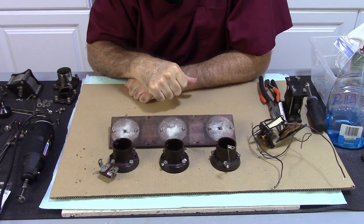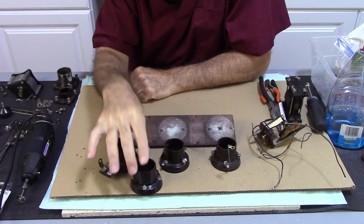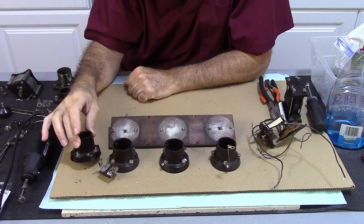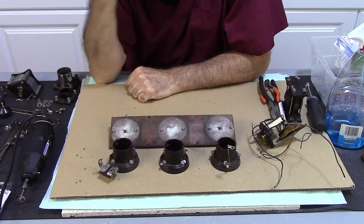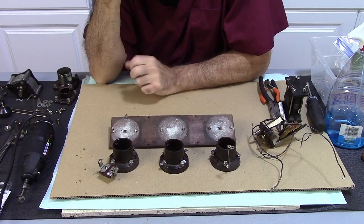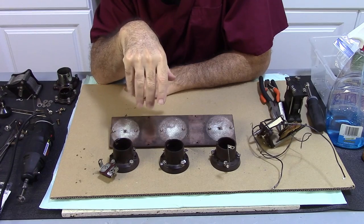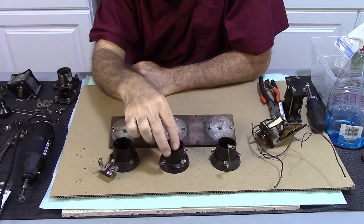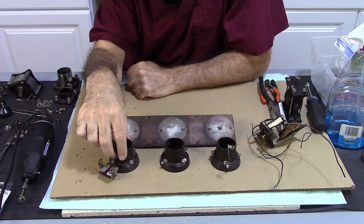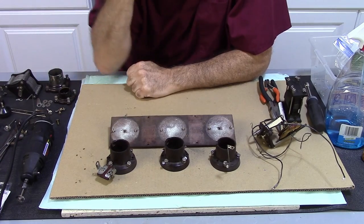But doing some research, one of the things I discovered was two of my ZR4s actually have this tube socket in it. So this is out of one of my ZR4s. They are identical. I did a little research, discovered that these are made by a company called WSCO. Now I can't really find much more information other than that, but what I'm assuming is the ZR4s were made for Gimbel department stores, and they tended to cheapen the Chelsea radio cabinets and probably some of the components as well. So I'd assume that when Gimbel's contracted with Chelsea, they probably had these tube sockets put in because they were a lot cheaper to make than these more robust Chelsea tube sockets.